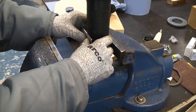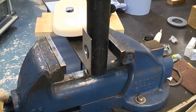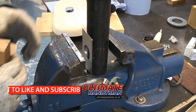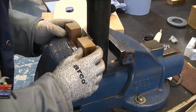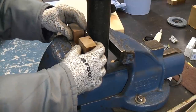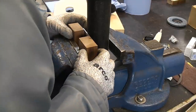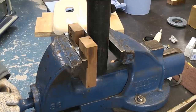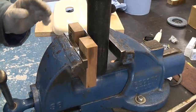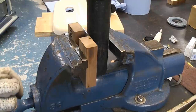I'm now going to attempt to put a little bit of a curve on that piece, and that should make it sit a little bit better. I'm not entirely sure if this is going to work but we will try it. I'm using a piece of strong steel pipe at the back of the vice and then two blocks of wood. Vices like this are very powerful but it's just a little bit tricky bending it this way. I've now got it roughly where I want it and I think everything is pretty much parallel, so when I tighten the vice up that should bend it slightly around the steel pipe.